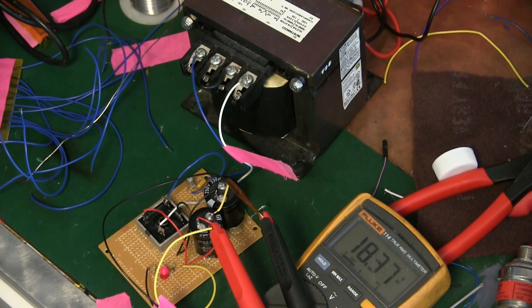Here's Red Hot Angry Pixies. We're starting to get into electro-boom territory — going past what is typically healthful in regards to electricity, what makes your penny pucker. I am just tweaking the Variac ever so slightly and it's just jumping. 200 volts DC, 250 DC, 300 DC. We'll go to 400 and that's starting to get the terror sweats.